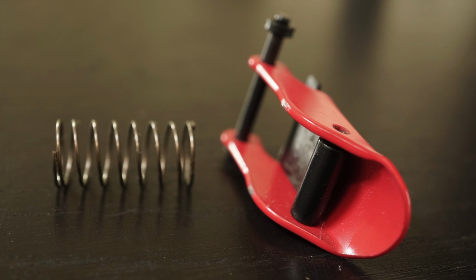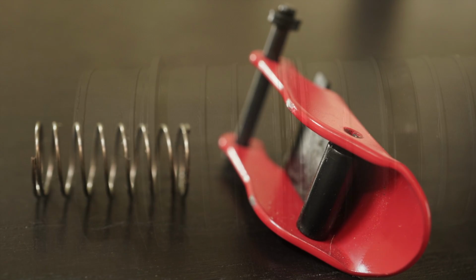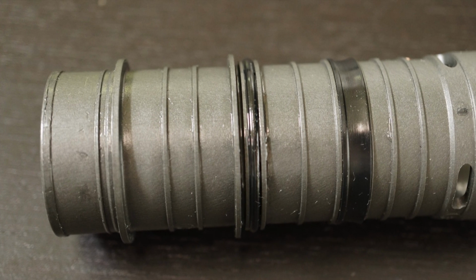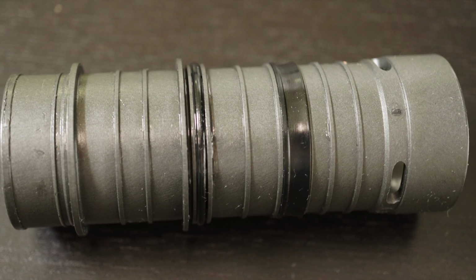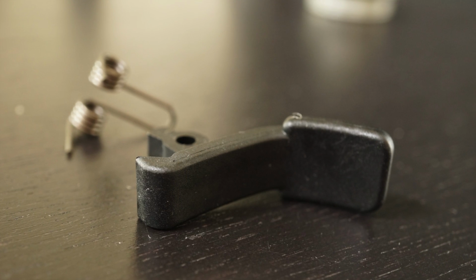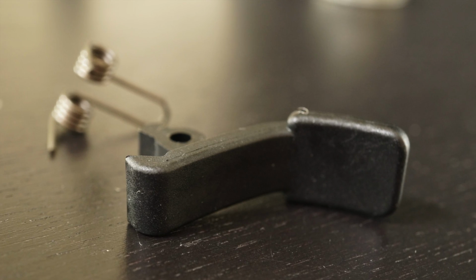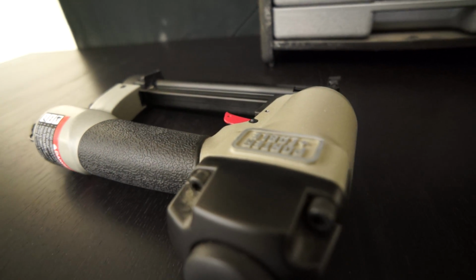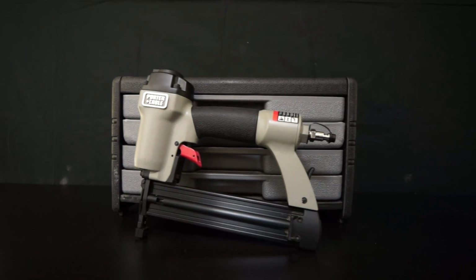All of the plastic parts, the trigger, the backstop on the end of the slider rail, and the plastic tube that guides the piston head are all made of plastic. This is likely because plastic is inexpensive to produce and because of its low melting temperature. These parts were likely made by injection molding. Upon closer inspection, one can see what appears to be a parting line where the two halves of the injection mold were joined together. Modern day manufacturing utilizes these different processes, and the end result is a quality product that is very useful to the consumer.